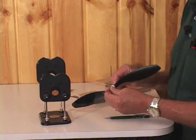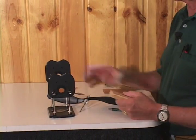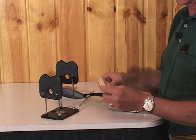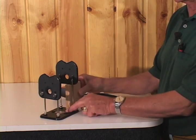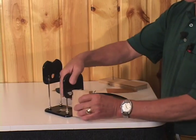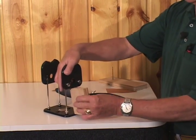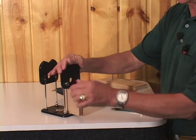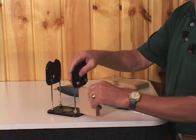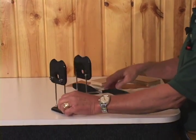We also have to have the balancing heads at the proper height to clear the prop blade. To get them both the same, use any kind of a block of wood of size, like I've done here. Turn it around, get the other one, put a block under the same head, snug it down. Now you know you've got them at exactly the same height, which helps in balancing the prop.